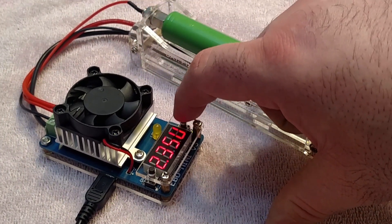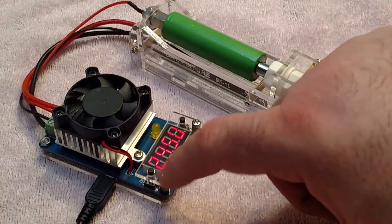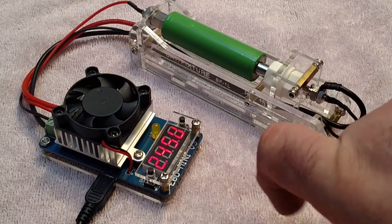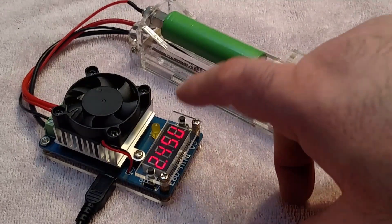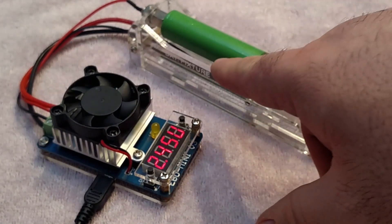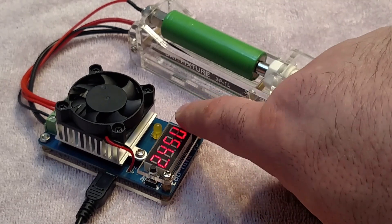This right button will let you cycle through. Now we're on volts — we'll change that to 2.45. It's at 2.35 now. The left button will bring that up. Now it's at 2.45 volts. This is the cutoff voltage — this is when this unit is going to stop working, so you don't over-discharge batteries. That can be set anywhere from 5 volts all the way down to pretty much zero. So if you are doing alkaline batteries, you can drain them to zero, but if you have an unprotected lithium-ion battery, you can set it to 2.5 or whatever for safety's sake.